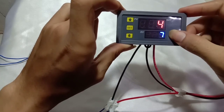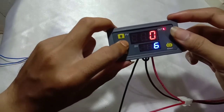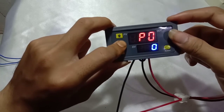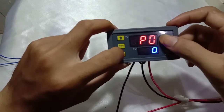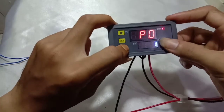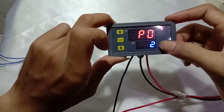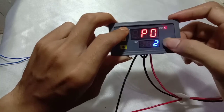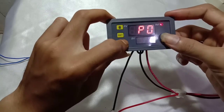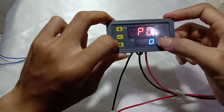The red one is T1 and the blue one is T2. If we press the set button for five or six seconds, the display will change. P00 means the setting is in seconds, P01 means minutes, and P02 means the setting will be in hours — it can go up to 999 hours. I'm using P00 here for setting in seconds.